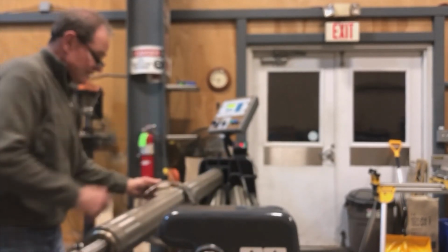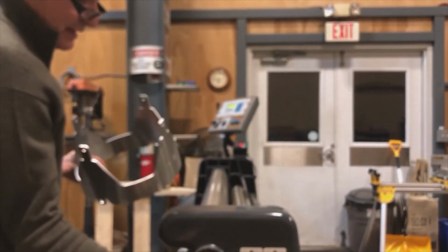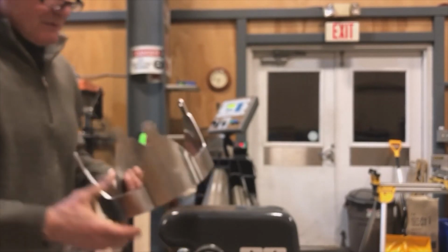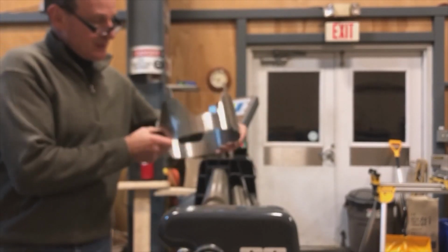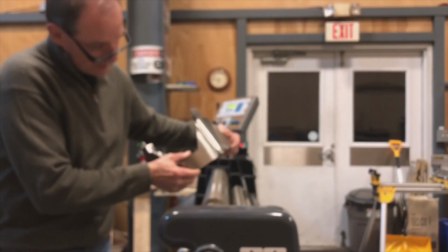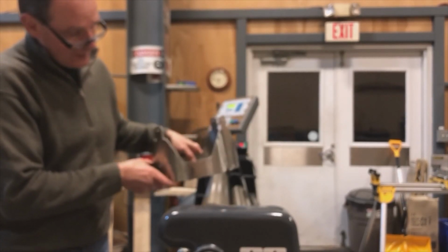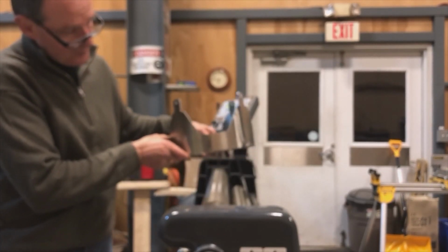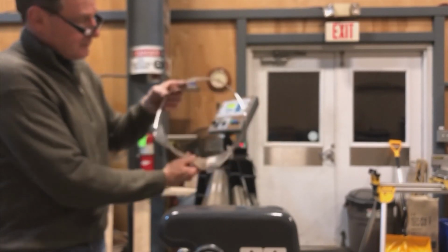We don't need to change our pinch. Consistent pinch is very, very important. And see now with those bending values, we are getting very, very close to where we have very little overlap, and I'm reasonably straight if I do it with two hands. If I snap this together, I am going to be right where I want to be. Okay, there you go. Nice and round.